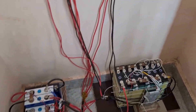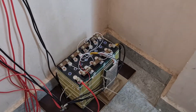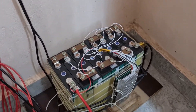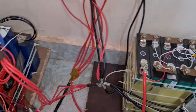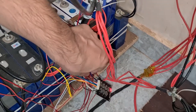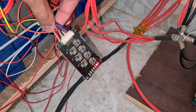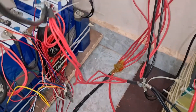All the Victron outputs are connected to the batteries in parallel. That's the 90 amp hour battery pack which I built — I'll leave a link so you can check that out and build your own lithium iron phosphate batteries. On the other side I have a 180 amp hour lithium iron phosphate pack, also built myself, and I have a balancer to balance all the cells individually.